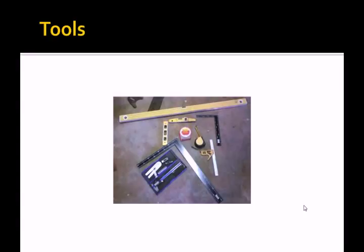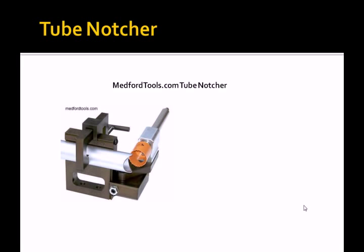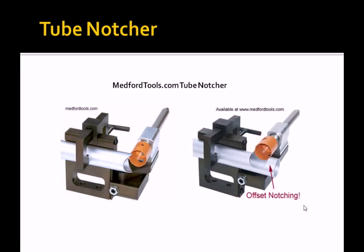Something to cope or notch the tubing — this is the tool that makes the notch in the end of the tubing prior to welding to another tube. For example, welding the down tube to the head tube, it needs to make a cut that is the shape of the tube it's going to be welded onto, at the correct angle so the two parts fit snugly before welding. Tube notchers range from around $100 to $260. The job can also be done with an angle grinder, but this needs a lot of skill, so don't do it if you've never done it before.